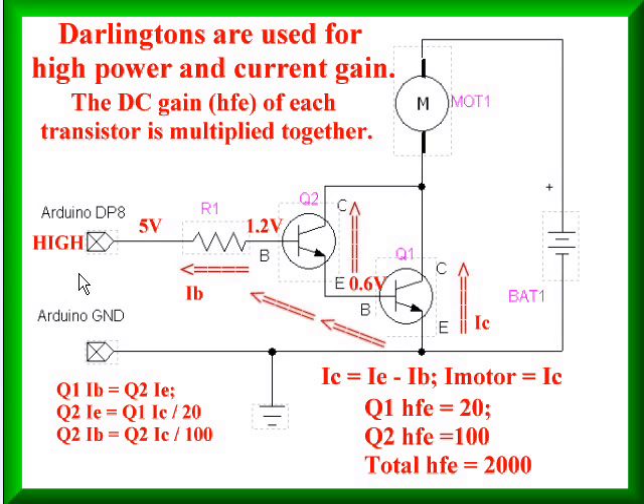That's well below what the Arduino or other microcontroller can supply. If I connected a voltmeter to the common and measured at the base of Q1, I would read 0.6 volts — because a forward-biased semiconductor junction, base to emitter, reads 0.6 volts. If I go up to the input, it's 1.2 volts because I have two junctions in series. So this is your basic Darlington configuration: one transistor boosting the current and feeding the base of a second transistor.